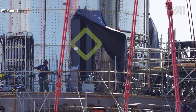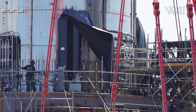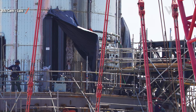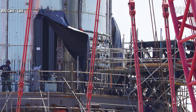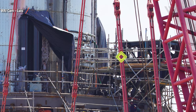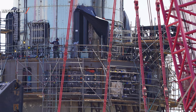Then comes another set of two giant COPVs. The booster is much larger than a Starship and features almost five times the amount of engines, so a lot of COPV capacity is needed. All the way on the right, we can see the fueling port. It has two large inlets — one for methane and one for oxygen — and several smaller ones around it. Those are backflow valves, mainly to suck out air and keep the pressure inside the tank stable while fueling is underway. Finally, we have the fueling arm reaching up from the pad itself, which when finished will extend inwards to connect to the fueling port of the booster.